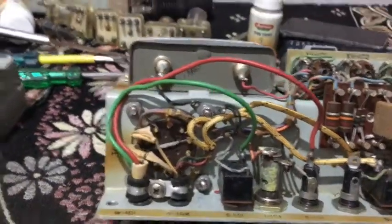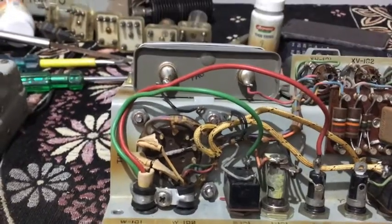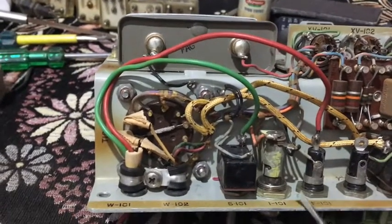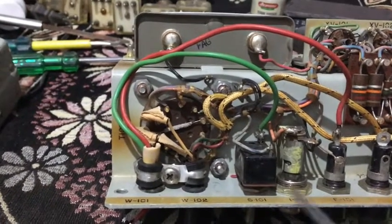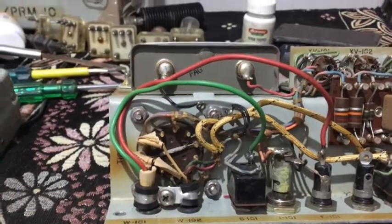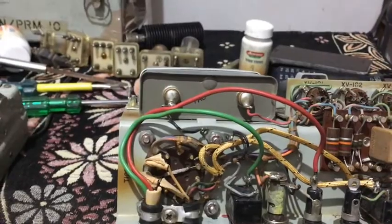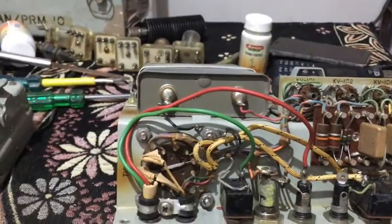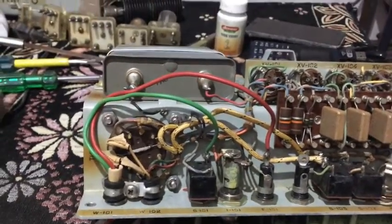What I am seeing is that I have to go slow now — print out the circuit diagram and address why this fuse is not showing continuity. This lamp seems to be in-line, meaning it is connected with the power supply. I have to print out the circuit diagram and press on. I have a valve tester and I have to make another power supply. I hope that it works because I really need this instrument.